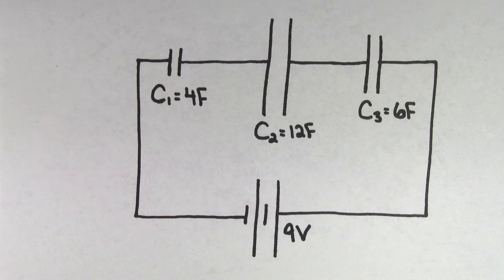To figure out why, and to figure out how to properly deal with this type of scenario, let's look at what's actually going on in this example. When the battery's hooked up, a negative charge will start to flow from the right side of capacitor 3, which makes a negative charge get deposited on the left side of capacitor 1. This makes a negative charge flow from the right side of capacitor 1 onto the left side of capacitor 2, and that makes a negative charge flow from the right side of capacitor 2 onto the left side of capacitor 3.